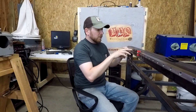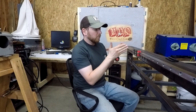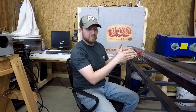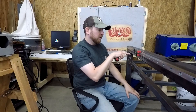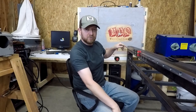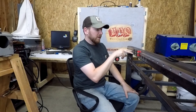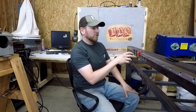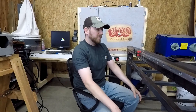What's going to be on this block is four holes spaced about like that — I wanted them as close as possible. The block will mount right about here. In the model I have two and a half inch, but I'm going to use three inch, which I think will work out pretty well — I'm going to have the overhang down below. That'll let me mount a couple pieces of angle iron so I can put the cable track on it. I'll spot drill these eight holes plus two more, and that'll let me mount the gantry on it threaded directly in.